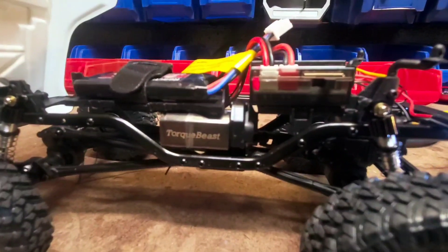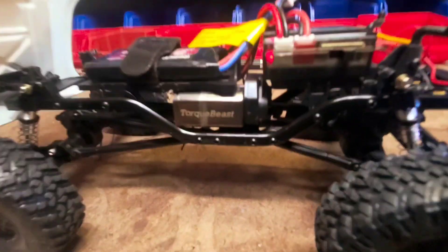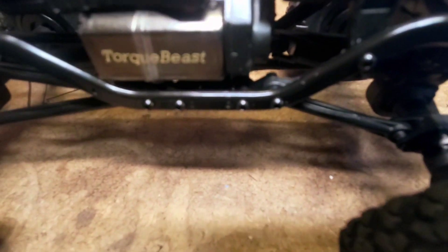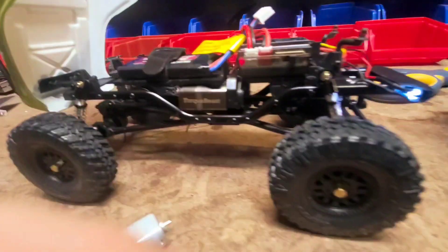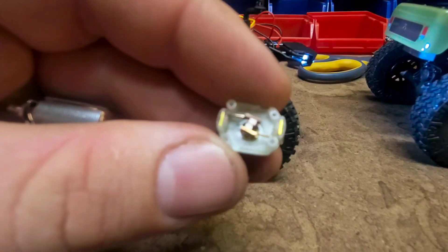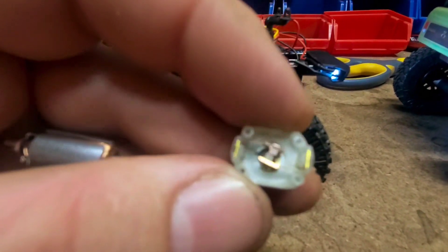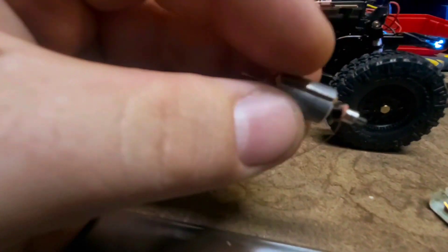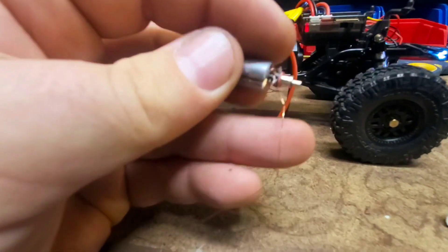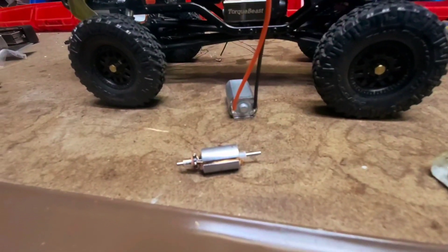So I went with carbon copper alloy brushes, and I think they're actually a little bit bigger than the original ones. Here's the inside where the brushes are — those are copper and carbon alloy mixed together. Very large, especially when compared to stock where stock is just a metal tang hanging out there. These should last a really long time. Here's the armature. I went ahead and unwound one just to count physically the windings. I usually tell them what specifications I want and then I always double check them when I get them.